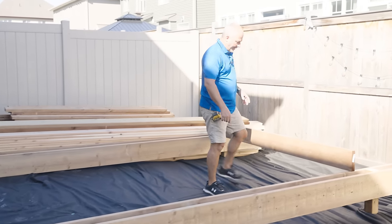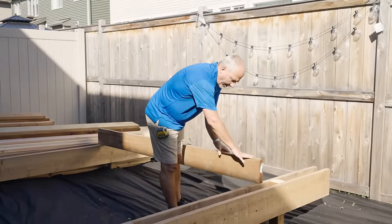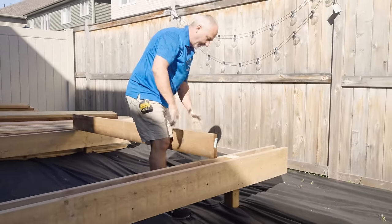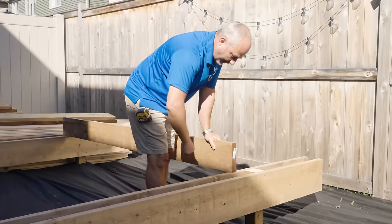We set them up so that they're 8 feet apart. The goal here is to have the second set of the structure resting on this, which translates all the load into the post, into the block in the ground, right? So we're gonna have a ridge, we're gonna nail it all together, and want all these joists to have resting on the box beam, okay?